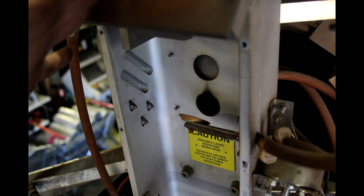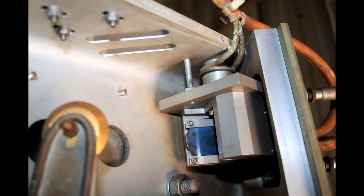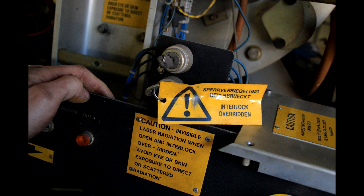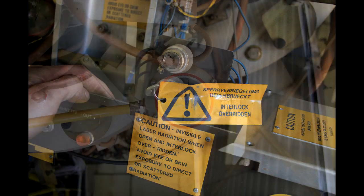Further down there's a mirror that can flick into the beam path to deflect the beam into a water-cooled load dump, as a quick way of turning the beam off. There are also various controls and interlocks at this end, because you need to have the beam on at certain times for doing alignment, so there are safety warnings and interlock systems here.